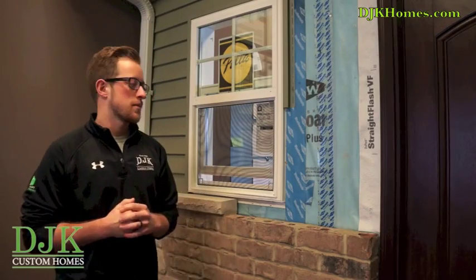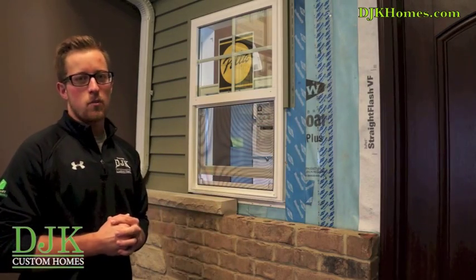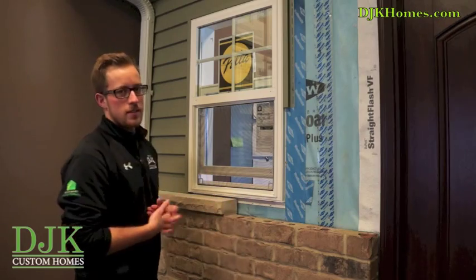One important thing to note on homes — sometimes you'll see this blue WeatherMate house wrap, but you won't see what's actually behind it. Many builders today are just building with typical construction methods: house wrap right over OSB, which causes multiple moisture issues. We do one inch of DOW styrofoam behind the house wrap before you get to the OSB board. We also use the WeatherMate Plus taping system on all of our windows, as well as this WeatherMate sill pan. What the sill pan does is it prevents any moisture issues — it wicks the water away from the window instead of allowing water to get behind the window on the sill.